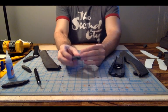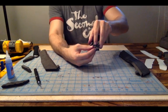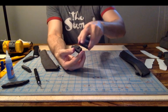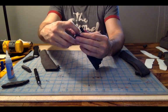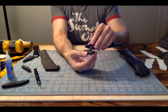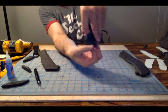Okay. Just like that, this here is going, you can see where this is going to sit, it's going to sit down below. So that little top piece we just attached is going to hit just below the top here. So about a 16th to an eighth of an inch down from there is right where it's going to hit, and these little pegs will fit right in that groove. You can see I'm kind of dry fitting it already. That's where it's going to sit, just like that.